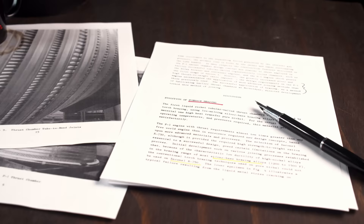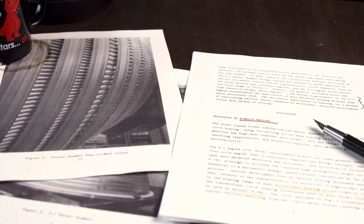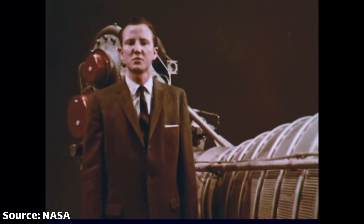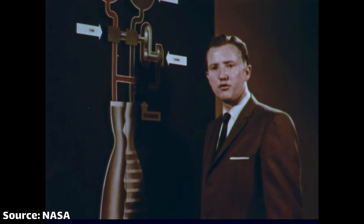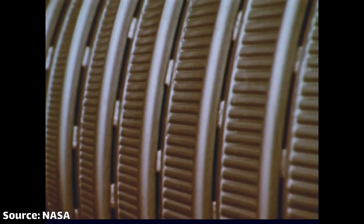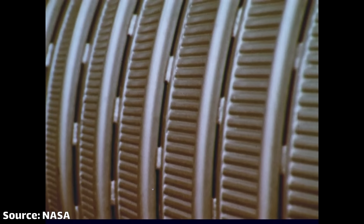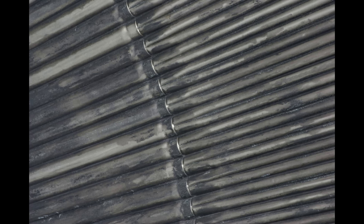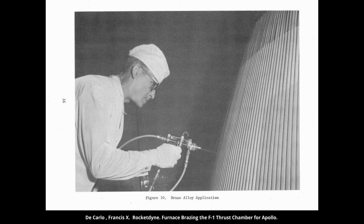Everyday Astronaut has a really good video on this topic exploring all the different ways to cool a rocket, so if you're interested in more details, check it out — the link's down in the description. So back in the early days of spaceflight, if you wanted to use regenerative cooling, you often brazed thin pipes along the exterior of your combustion chamber, and the pipes flowed the coolant throughout the system to extract the heat. This is the method used on the F-1 engine on the Saturn V rockets. You can see the tubes running up and down the nozzle here, and they extend up into the main combustion chamber. It's relatively heavy because you have thousands of extra steel pipes that you need to bond onto the engine, adding a whole lot of extra mass. The brazing process generates thousands of joints that need to be inspected to make sure all of them are absolutely perfect.